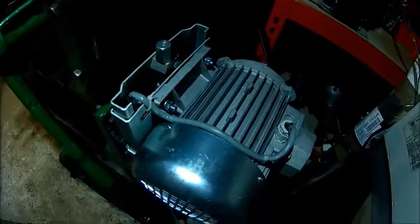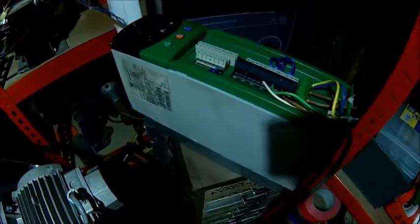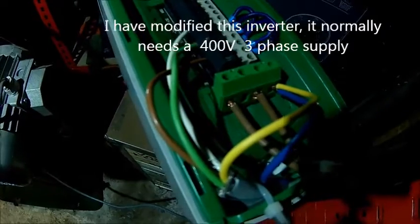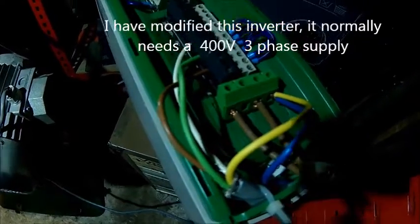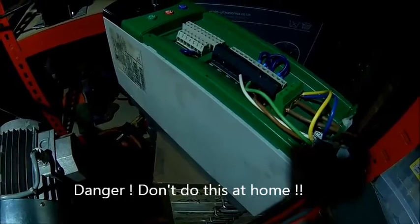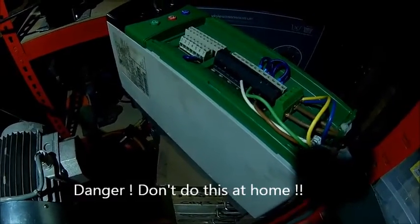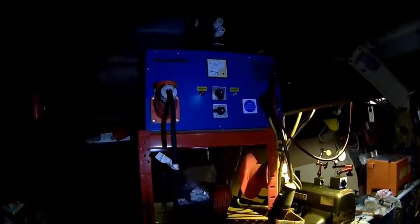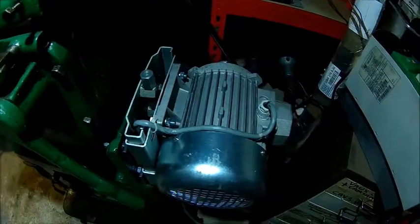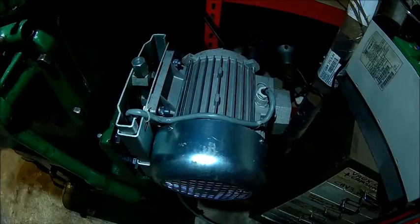I'm running that off an inverter, which is actually this one here. The supply is a bit unusual — the electrical guys may notice there are only two wires, not three. The reason is I'm feeding that inverter from a transformer, which gives me about 440 to 450 volts. You can do that if you consider a few things. I may make a video about that because it's simpler and easier than a big phase converter like the big blue one up there. I've got one of those as well, but that usually runs the mill because the old motor of the mill is not really inverter-rated — it's from the 60s, so you don't want transients there.